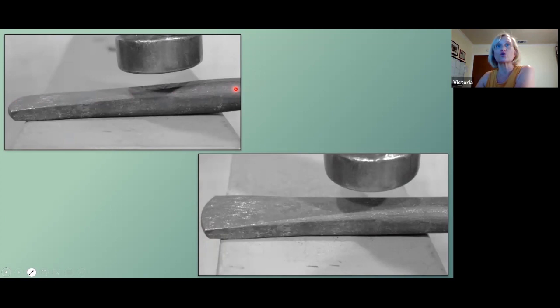and follow that back up towards the middle of your tool. You want your indexing to meet this taper somewhere in the middle. Don't dress the sides at this point. The only reason this is flat is because we started with those little flats. You want to keep this growing as wide. It's one of the few times when you can just let that width happen naturally.